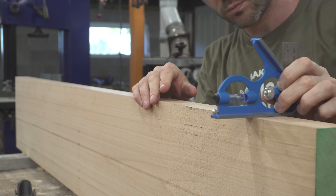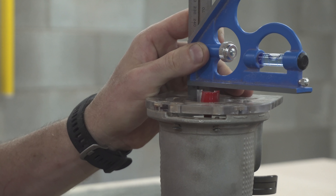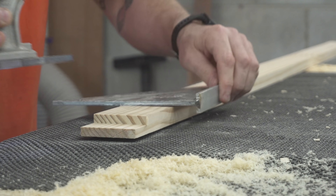After that I was back to the leg assembly to cut them to length and start working on the mortise and tenon joinery. I start by cutting the mortises — I get rid of most of the waste at the drill press and then use a router to hog out the rest. The nice thing about using the router is that you get a very nice flat inside edge. Next I cut the rails — the two long rails are different sizes. The thinner rail is there to allow the cabinets to roll in underneath, and this is also the side you'll be sitting at most of the time. Then I use the trim router to remove the waste for the tenon, sneaking up on it.